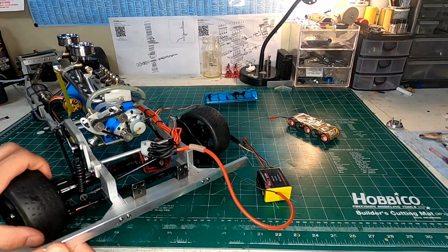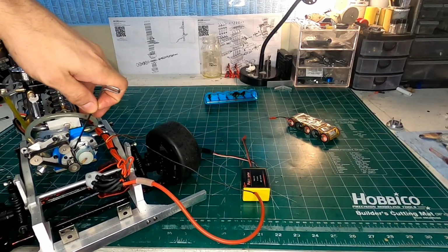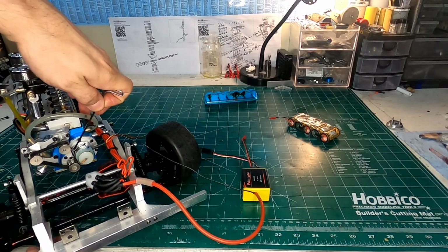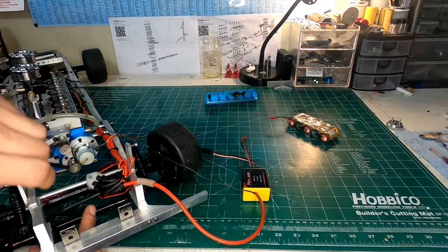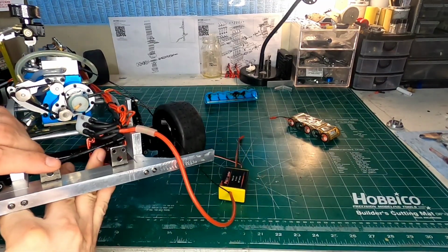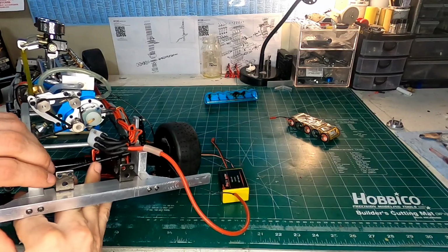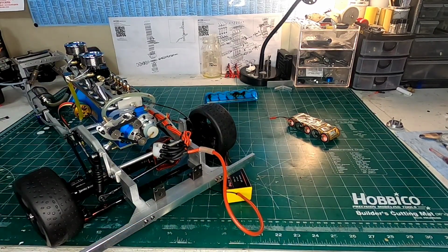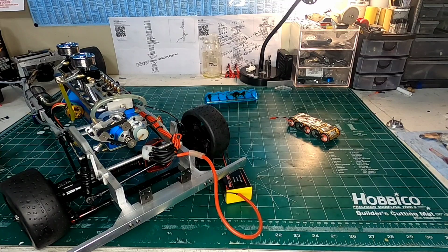So if you look at where my setup is on my distributor, my capture is almost bottomed out at the end here. So that tells you that I'm all the way over. I don't have any more adjustment, and really there's not much more to go. I have very little room between this distributor and my belt. I don't know if you can see that in the video there. So I have mine set at 12 degrees. That's been running for me. I've got videos of it running, so you guys have seen this engine running, and it's running on 12 degrees.